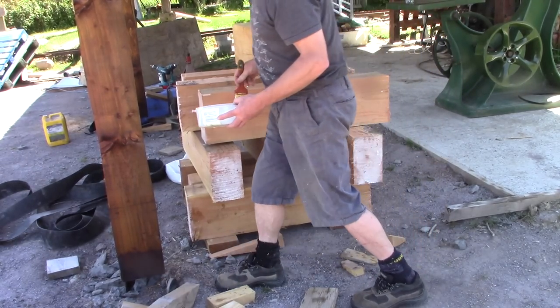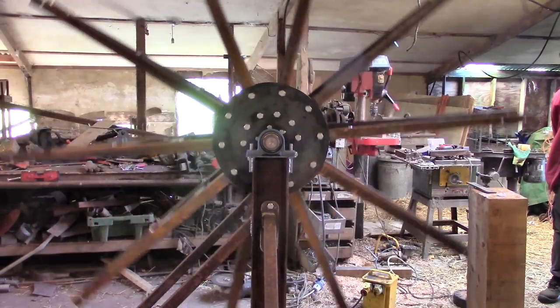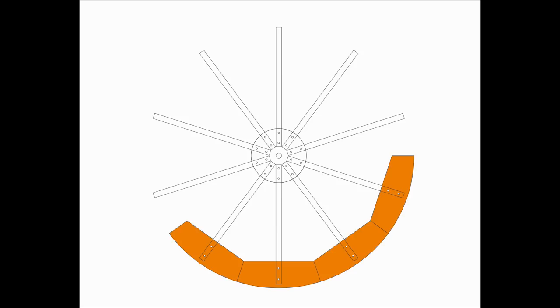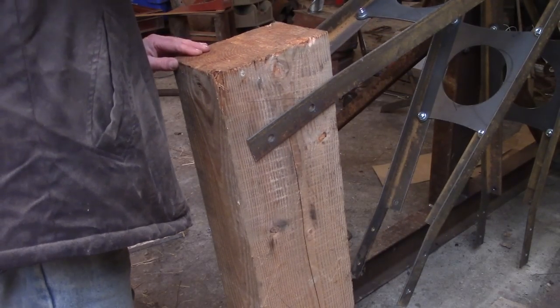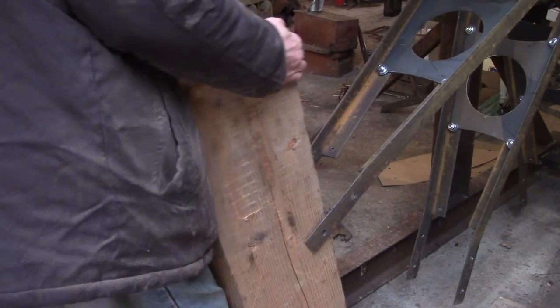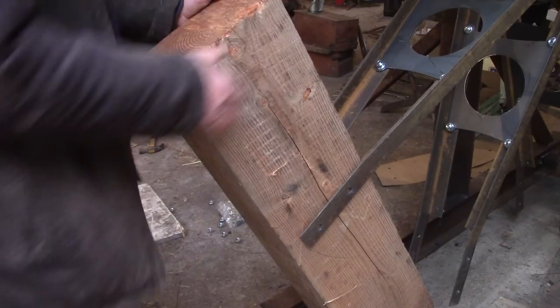Fast forward a few months and I'm ready to use them. They are for the fellows on the big wheel — the wooden pieces that go round the outside. They should give lots of weight at the outer edge of the wheel, which will add to the momentum, because momentum is another way of saying weight in motion. So once this wheel is spinning, it will try to keep spinning. There will be one wooden fellow for each pair of spokes, and long bolts will go right through from one side to the other, trapping the fellow in a spoke sandwich.